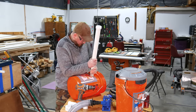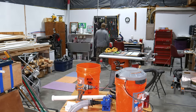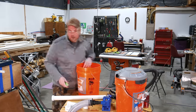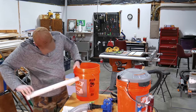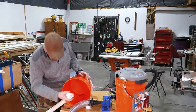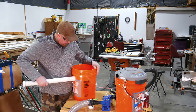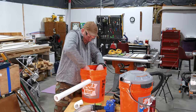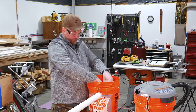As you can see here I'm struggling just a little bit to get the pipe in the hole, but that's nothing a utility knife and a steady hand can't fix. Now the next piece is somewhat critical. To maximize the effectiveness of the dust collection system you'll want to create somewhat of a spinning cyclone action in the dust chamber. This will cause the dust to swirl around in the bucket and eventually drop to the bottom instead of getting sucked into the vacuum.